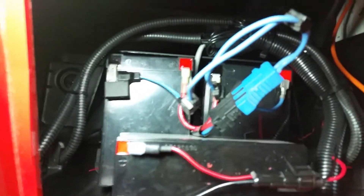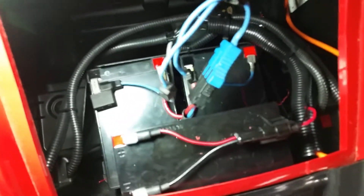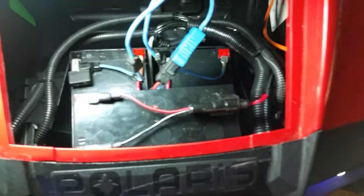We've got three batteries in here. I've got two 12 amp hour 12 volt batteries running in series so they're 24 volt, and I've also got a 12 volt up here that runs all the lights and electronics. I prefer doing it this way instead of splitting off one of the batteries and having to disconnect and balance charge them individually — that's a waste of my time.